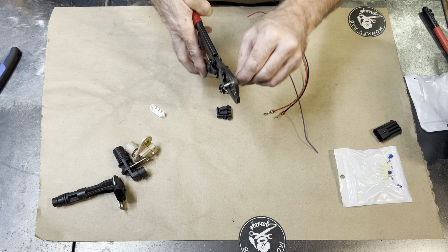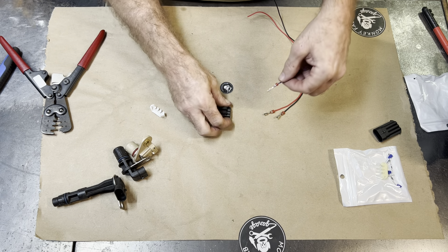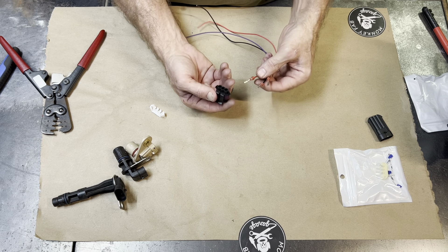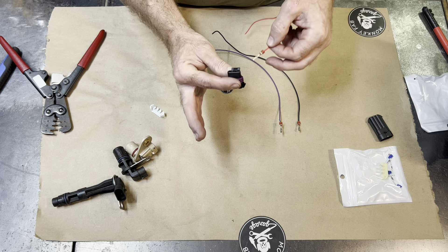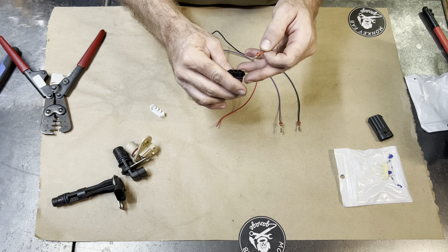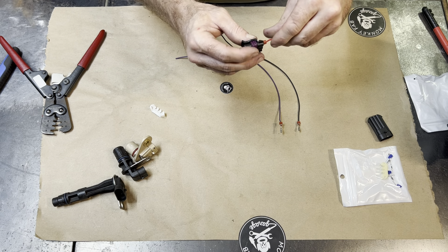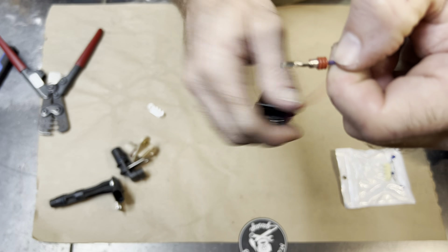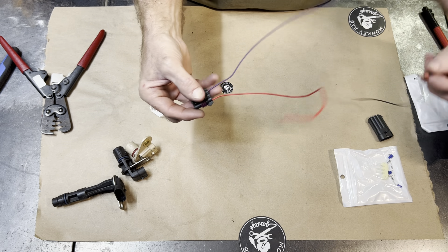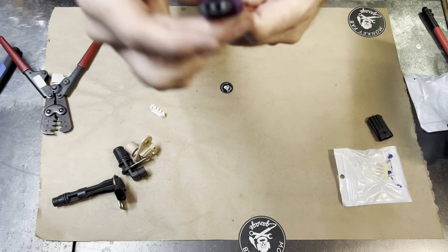And there we go, last crimp. We'll get this to go right there on the silicone, and now it just goes in here. Be sure you're verifying what you've got. I can't tell how these are supposed to go in — there's a lock. The clip is at the top, and if you look at your pin, you have a little protruding guy. That protrusion goes up towards the pin, just like that. Protrusion up towards the pin until you hear the click. And we're all clicked in. That's how you pin those.